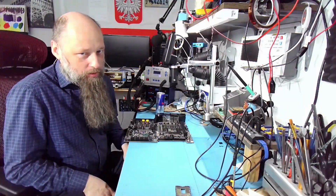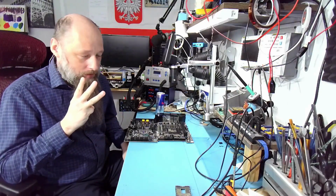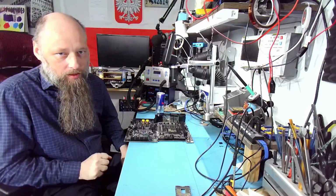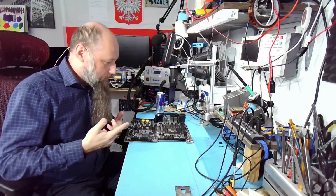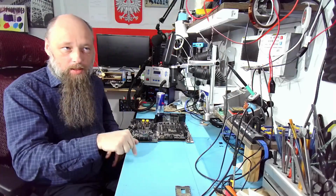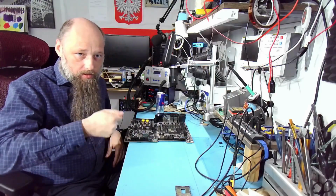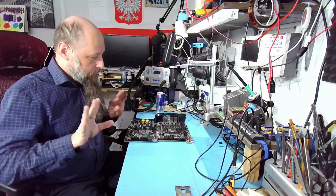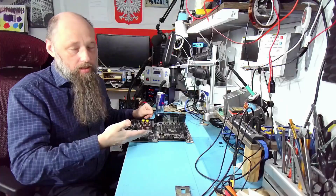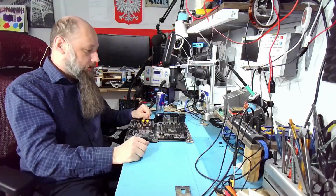Whew, that was brutal. I don't know if you guys noticed, but it took 3 cycles to actually detach the socket. And it just popped up very nicely, but there was one point where one of the pins was really difficult to let go. And obviously, don't try to force it. If it's not coming off, it's not coming off. Just leave it be. Just keep the temperature high and steadily increase the temperature if need be.